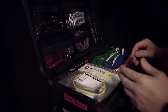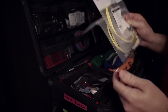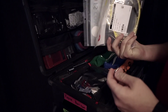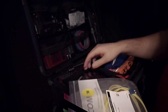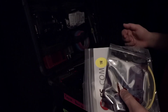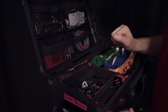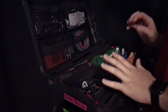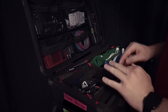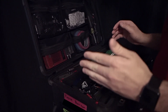Right on top I have some fiber optic patch cables. We use fiber for just about everything, and this is your number one fail point. So I always have a couple of extra fiber patch cables just in case, as well as fiber couplers — both LC and ST. We use ST for our trunks. When I first got my Pelican, I just had an empty base with the lid organizer and it was awful. I really recommend getting the TrekPak system — it's worth the money. In this industry it's an investment; you're investing in yourself.